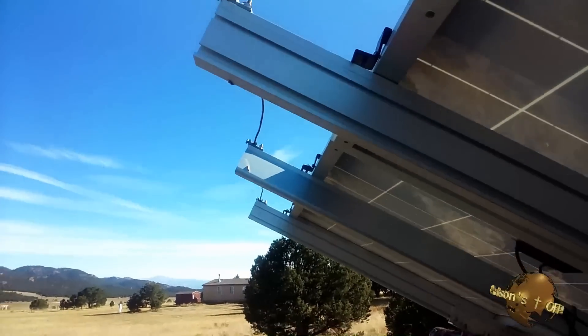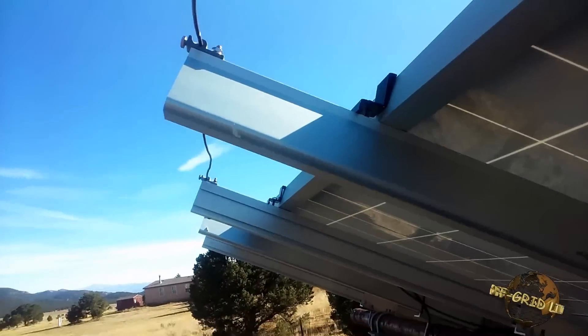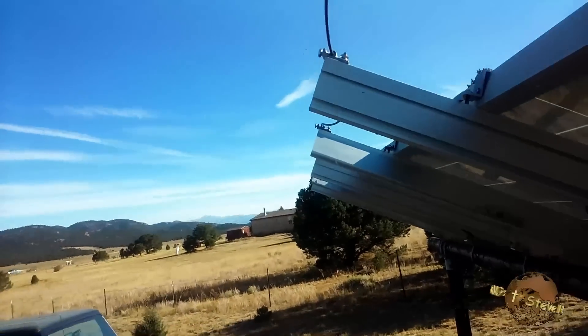The reason for that — especially with solar arrays and wind turbines — you can see I have a wire running along the top of my solar array. That helps dissipate static electricity before it builds up enough for lightning to strike. Now if we have a lot of heat lightning in the area, it's not going to help — if you take a direct hit, you're going to burn up, and that's all there is to it.